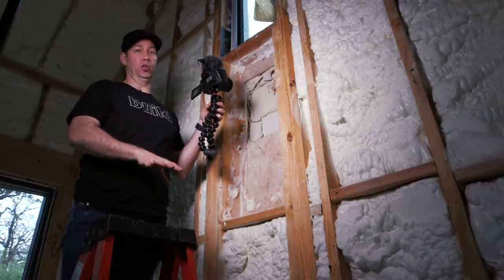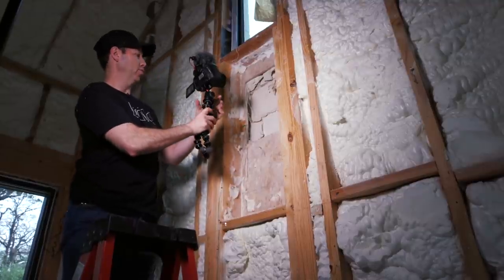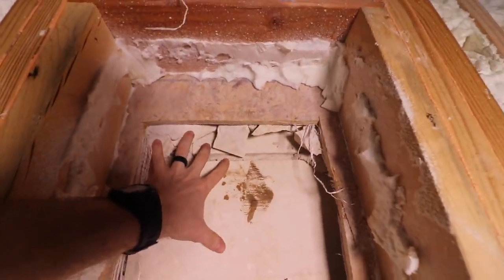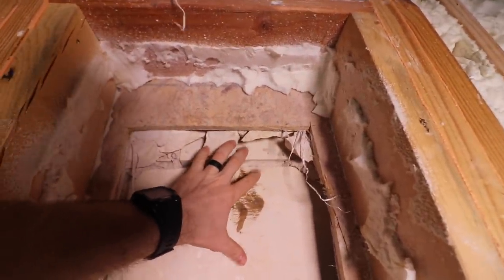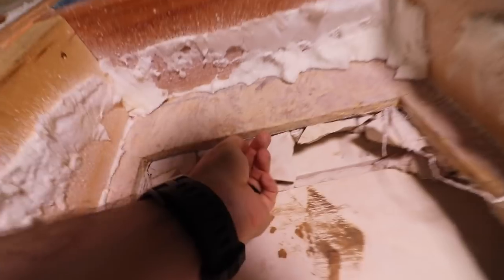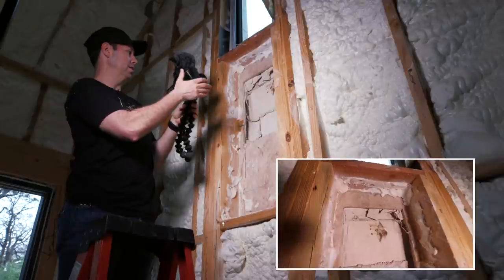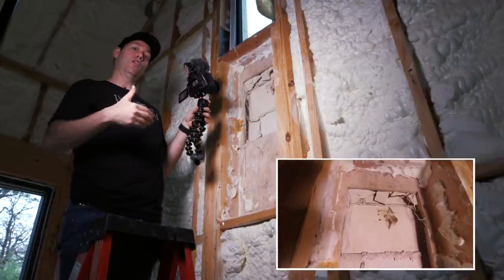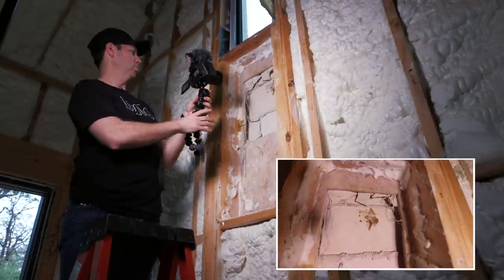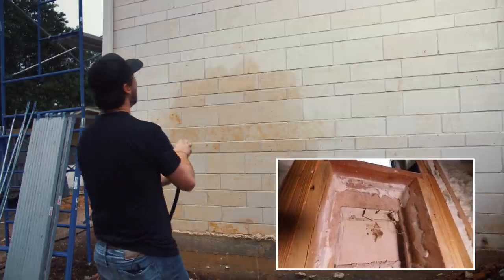Test number two. We proved that the field will leak. I'm curious to see what will happen at this window penetration. If you look here at the window, I've got my second camera going with my bird's eye view. We've got some packed mortar and some packed stone at the sill here, which means I basically have a direct connection to the house wrap. This area scares me a little bit more because now I'm actually getting liquid water that's going to run down the face of this house wrap. Let's see what happens. All right, Jordan, you ready? Hit it.